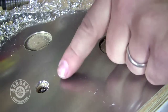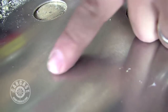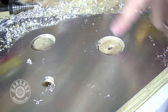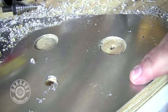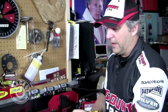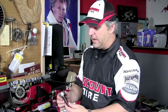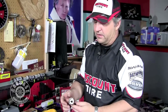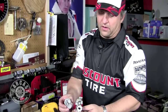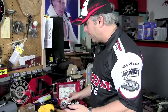For comparison, let's look at the unibit — since we went a little farther on thick metal, you get a little countersink, which is also nice because it leaves a clean, burr-free edge. Not bad. The hole saw is the worst and still not bad. So here's a couple of options for boring larger size holes. I really like the hole cutter kit from Blair — these are available online from automotive and tool places. Really, really good quality — this is a machined part versus a blade that looks like a hacksaw blade rolled around. We have a couple of good options here for boring large holes.